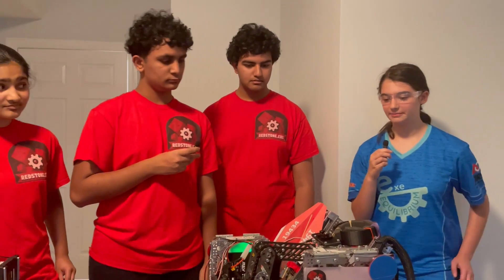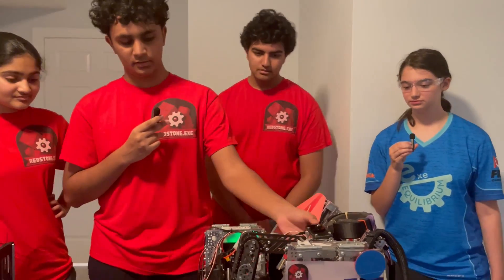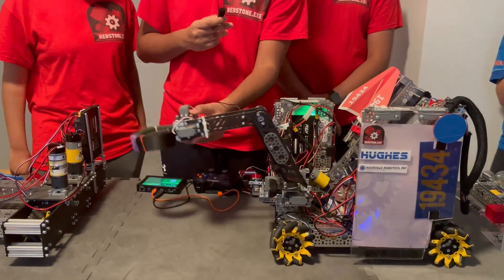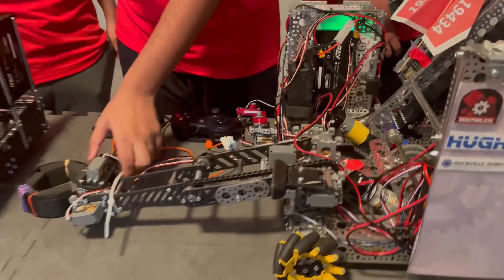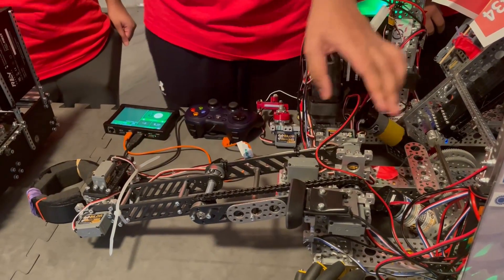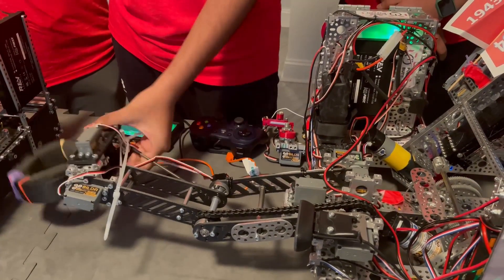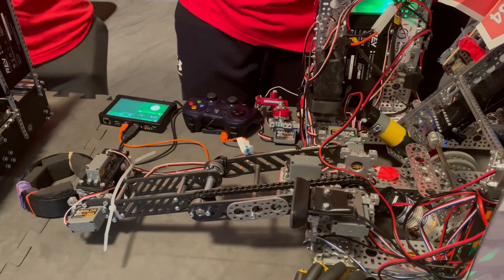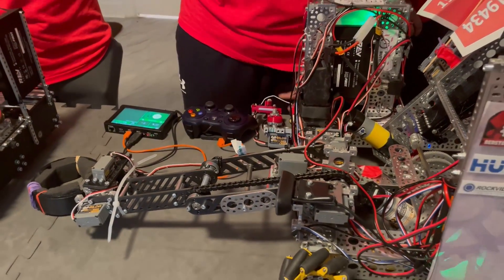Can you tell us how this works? I see you have some chain there — is it servo powered? For the first degree of freedom, we have two servos which control the main part of our virtual four-bar, and then another servo on the inside which controls the second part with a chain, giving us a lot of control even though the servo itself is not at the second four-bar. We have a third servo which turns the claw, allowing us to pick up from stacks as well as transfer it to our deposit mechanism accurately. We also have a turret but have disabled it for now as we are not utilizing it.